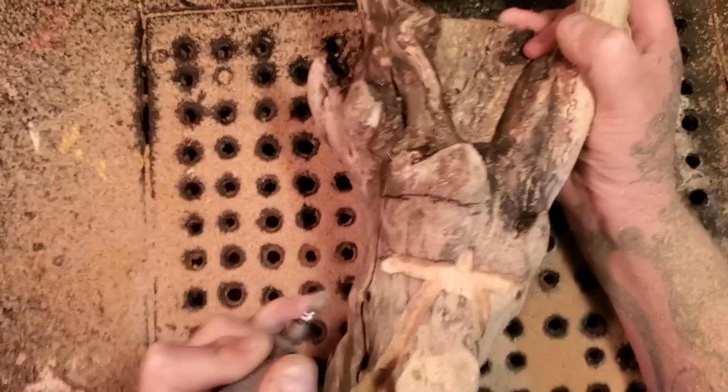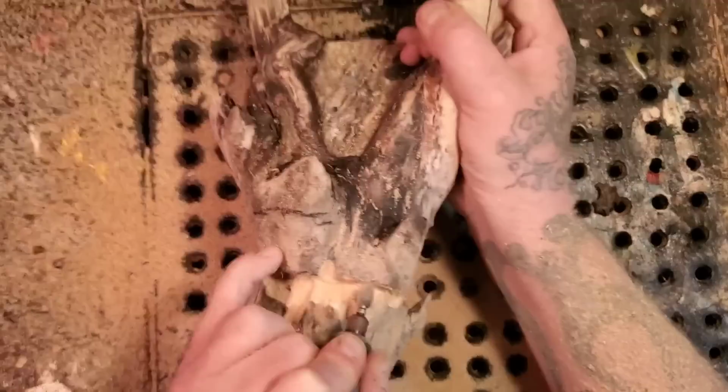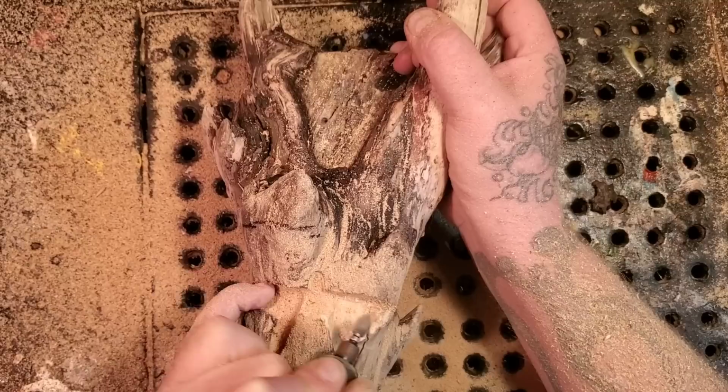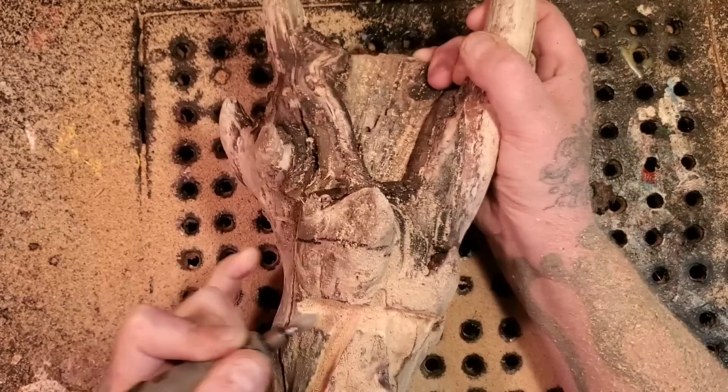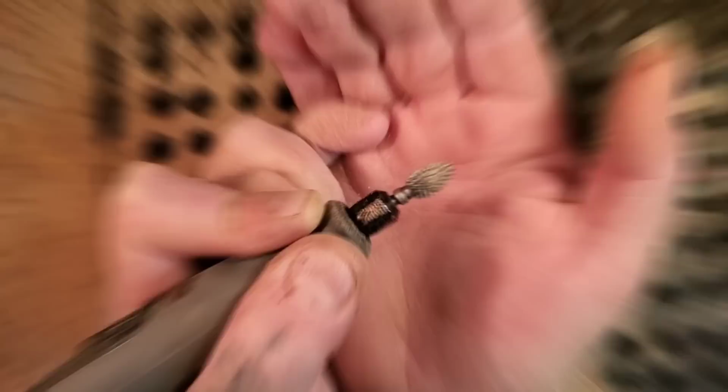If you're melting the tips of your burrs together, it's most likely because you're carving soaking wet wood. Just watch this. Watch the handpiece. Something's going on. You're carving soaking wet wood. It's getting plugged up in the burr. You're still running at full force at 30,000 or 35,000 RPMs, you're heating it up so much you're melting the tips of the cutter together. Okay? So last live video, I was carving that whimsical tree, and I broke a flex shaft. Okay? Watch this slow motion here.